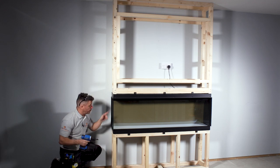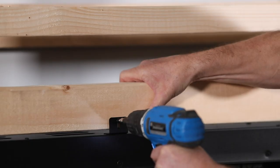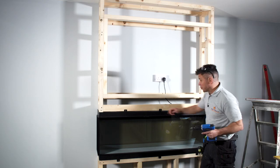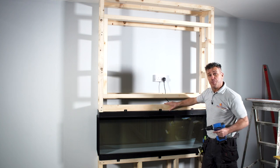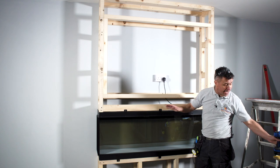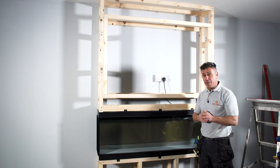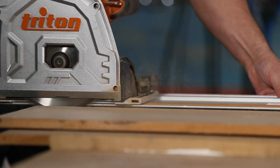I'm going to do the same on the opposite side. I've applied three further screws into the brackets we put on earlier just to hold the top of the fire into the bottom of this frame, and that is my structure now complete. The next stage is to clad it with 15-millimeter MDF — I'm going to cut the sections, starting with the inside section where the TV is going to sit.